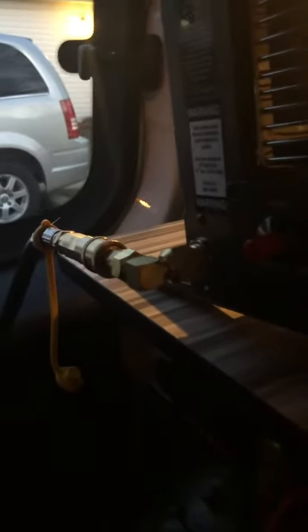Sorry it took so long, Haley, to make this video, but I had to wait for some of the parts to come in. I went to a quick-disconnect setup so I wouldn't have to keep threading it on and off the appliance. As you can see, it's glowing red. I've got the safety switch — it's a lever that came with this quick-connect. If I flip the gas off just by flipping up this lever — boom. See how quickly it turns it off? No hissing, and that's really nice.